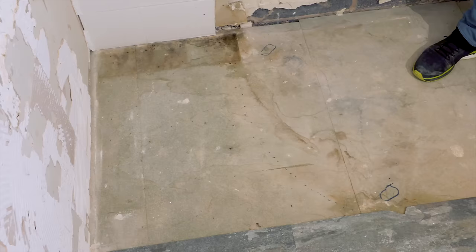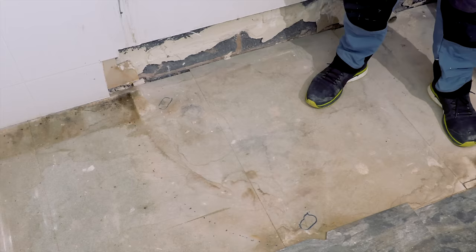With any shower installation, a bit of planning can save a lot of work. If you want a low-profile tray flat on the floor, you've got to find out where the joists are - the last thing you want is to cut into them to accommodate the trap. Also, when you buy the tray, find out where the waste is positioned; most give dimensions so you can work it out. This tray is going wall to wall, and I've worked out the joists are running across the floor where we need them.